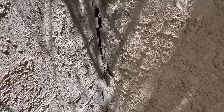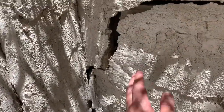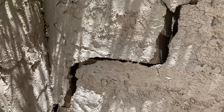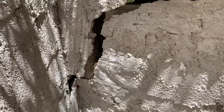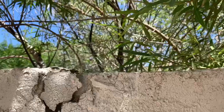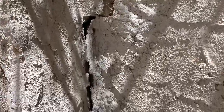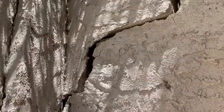So this is a pretty good crack in a block wall. It's been repaired before — you can see that somebody's tried to just fill it with concrete or some type of repair. At its widest point it's about three-quarters of an inch. I'm only looking to make a cosmetic repair. This is not structural by any means and it's not gonna last. I've got a big tree on the other side of this wall and I don't want to chop it down or cut roots out, so this will likely be a maintenance item. It's just intended to make it look better.